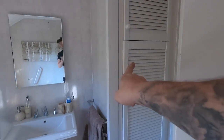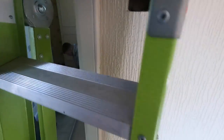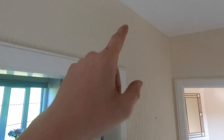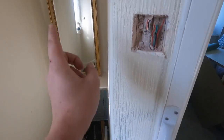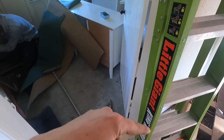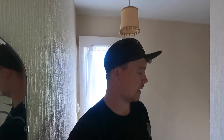Because this airing cupboard probably has a socket, and the shower will be going here, we need to get the cables up into the loft. There's also a socket going here, so we're going to use the zoning of the socket and this light switch to feed our smoke alarm feed upstairs, lighting feed upstairs, and then our three-core from our smoke alarm back downstairs into the dining room. We're going to do smoke in the dining room and a heat alarm in the kitchen, because there's a log burner in the lounge and a smoke alarm would just constantly get set off. Just do a check - they've got carbon monoxide as well.